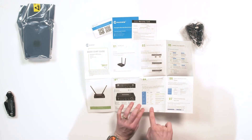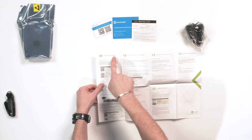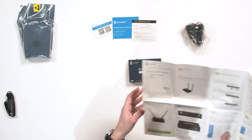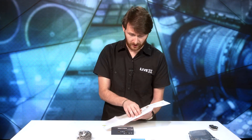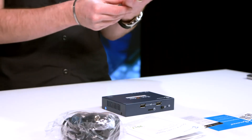Opening up the quick start guide — you have all your indicators for what the lights mean, right here. Flip it over and it tells you how to get it connected to the internet, how to log in, and how to get everything set up — whether you want to stream here or there, or record while you stream. That's something really cool about these encoders: instead of encoding to a separate machine and streaming from there, you can literally stream straight to YouTube, Facebook, Twitch, or whatever your RTMP destination is. Bring in video via HDMI, audio via 3.5mm if you don't want embedded audio, and you're out to the world.